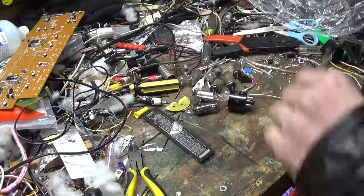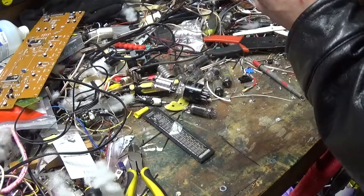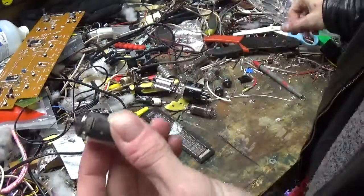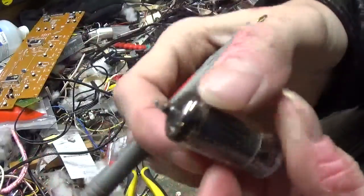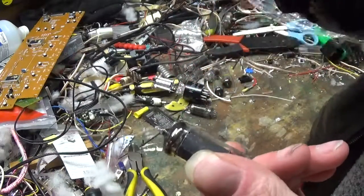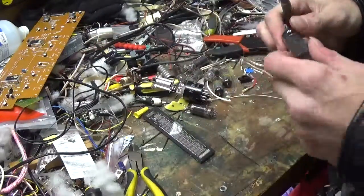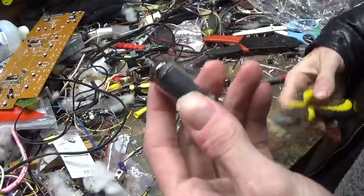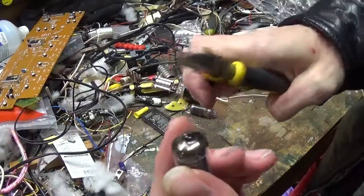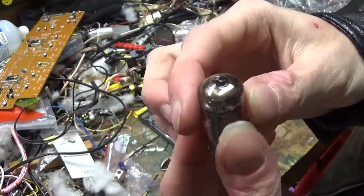They're all different. But I'll show you what happens when you break one of these tubes open. Let's go with this. This is a 12AU6. So now, look how nice and shiny and black that is. Now that works. Its main job and purpose is to pull out any impurities, any oxygen particles, any of that stuff from inside the tube and suck that to it. Keep all that out of there. So let's see here. That should quickly turn like a foggy white once it breaks. It should start going. Might take it a while, but it should start doing it.